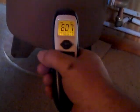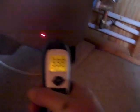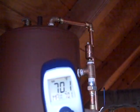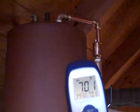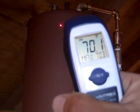We've got 60 degrees at the bottom of this tank, right around where the fitting goes in — about 59 or 60. At the top where the water is going in, we've got 70 degrees. So we have a 10-degree temperature differential — it's thermal siphoning, but real slow. That's okay.